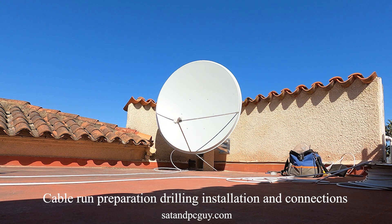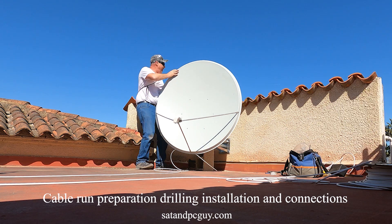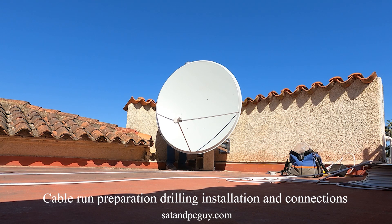It's always best to roll out the amount of cable that you need first, rather than taking it directly off the drum — otherwise this might cause the cables to twist and bend, which is not ideal if you want to install it in straight lines.